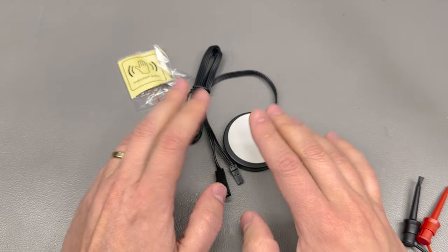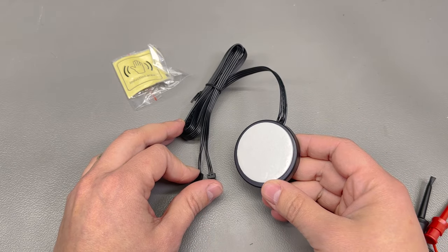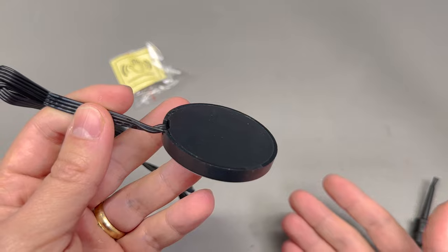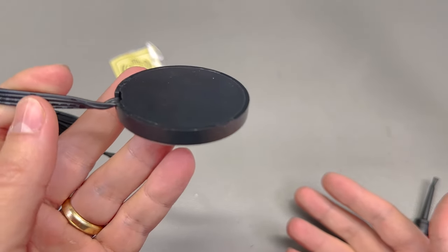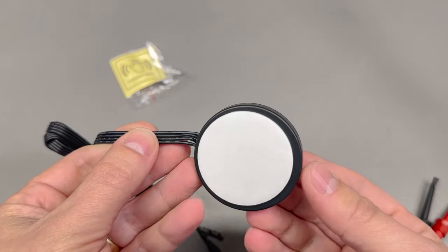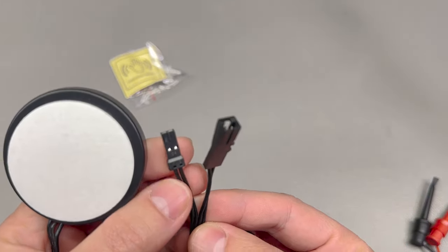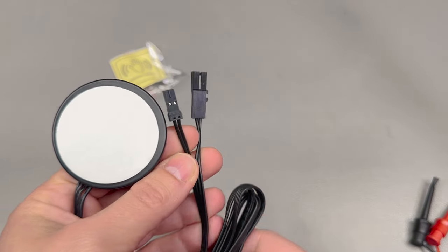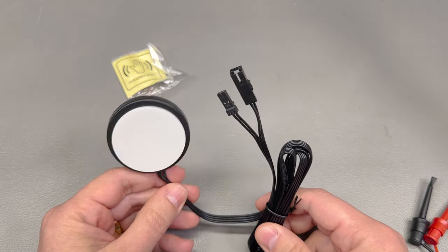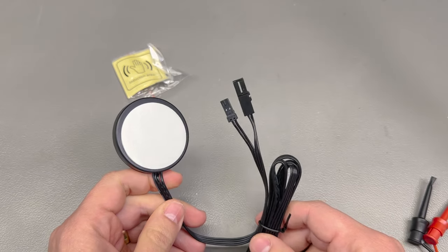My next product is in the same category — home improvement furniture lighting accessories. This is a touch proximity switch that you can embed behind a wood panel of up to 25 millimeters in thickness. Standard modern furniture panel thickness is roughly 18 to 20 millimeters, so this should work well if it meets the advertised working distance. It comes in black and white, and in two wiring options: DC jacks or Dupont wire connectors at approximately 2.5 millimeter pitch, to make it plug-and-play with certain LED tapes. It can handle 12 to 24 volt DC up to 60 watts.